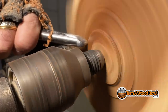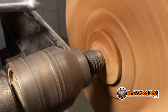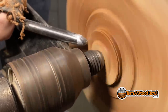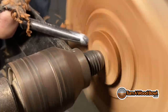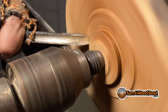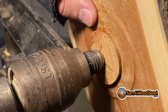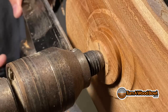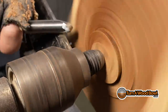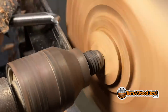I needed to speed the lathe up there — it's an interesting little illusion. Because of the frame rate of the camera, the lights, and the speed of the lathe, it looks like the lathe slowed down, but it's actually going faster now. Here you can see I'm cleaning up that inside corner of the bottom of the tenon to make sure there's no debris or any uncut areas there. That's looking really good. Now we've established the base of the bowl and we need to start creating the curve that's going to go up to the top of the wings.